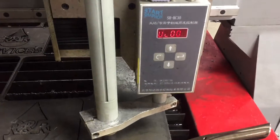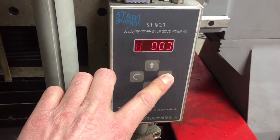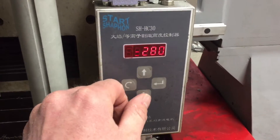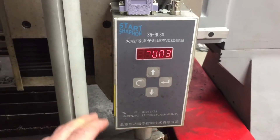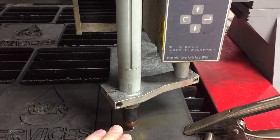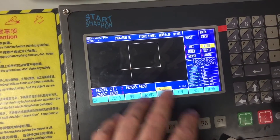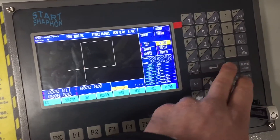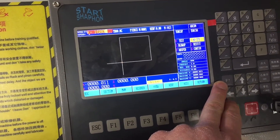So we're on 1 to 1 right now. With our plasma source on, you can see that our THC now has an LED panel. We're going to go in and set our voltage. According to the Hypertherm manual, it should be 126 volts to cut 3/8 plate. We go to A — A is the voltage — set it to 126 and hit enter. That will automatically float our head to the perfect specifications to cut this 3/8 plate. To show you it working correctly, I've loaded a sample cut: 1 inch by 1 inch square with leading tails. We'll set our feed speed to what the book recommends, which is 1680, and apply. Let's go ahead and cut — the LED screen will show you the actual voltage so you'll know if it's working correctly.